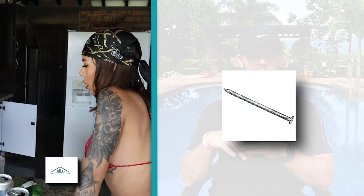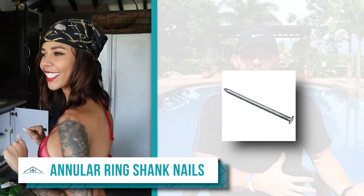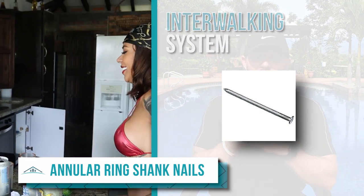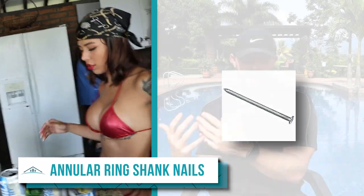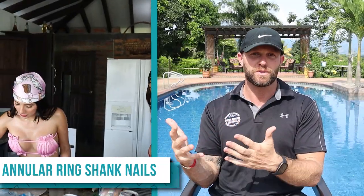The final shank nail that you're going to see is the annular ring shank nail. This nail is composed of many rings. Together, these rings create an intricate interlocking system, we'll call it that, which gives the nail one of the best withdrawal resistances. So again, this nail is going to be much better than a smooth shank in terms of not being able to be withdrawn easily or pulled off.